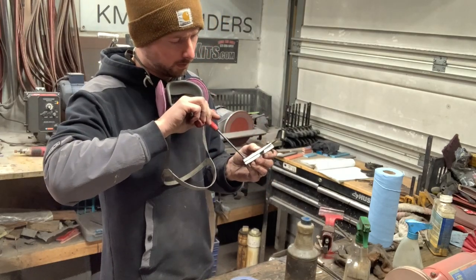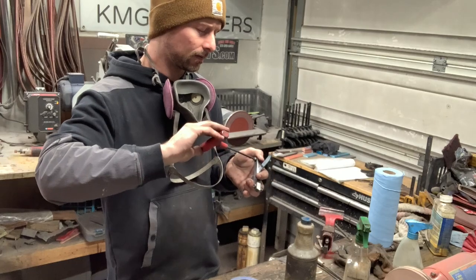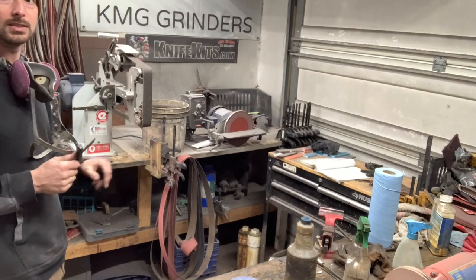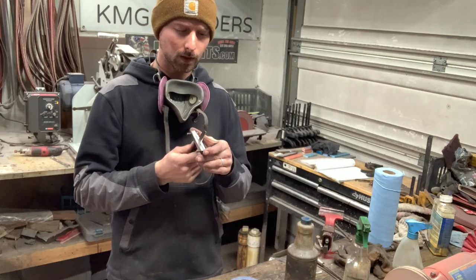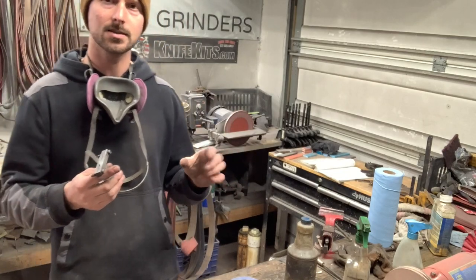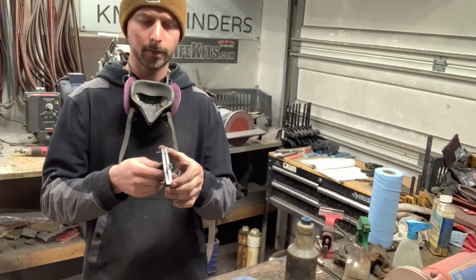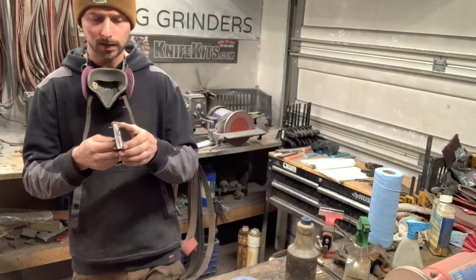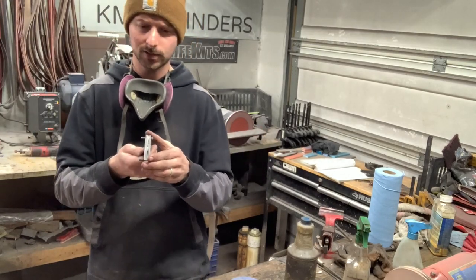And as far as grinding this thing goes, I normally start with a 36 grit belt. I do all my bevel grinding on the KMG TX grinder, which is another awesome sponsor for this build. But because this is such a small, thin knife, I'm probably going to start with a 60 grit belt, just because there's not a ton of material you have to hog off. So we're going to probably go 60 grit and then a 120 and then probably 180 and then finish it with a Trizact, I believe an A65 Trizact.